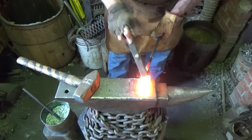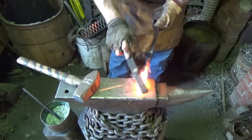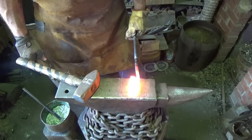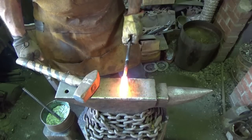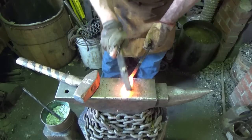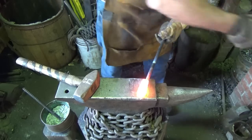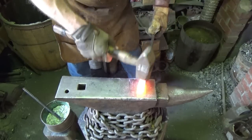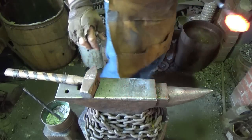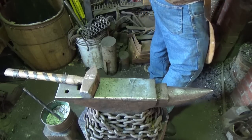Should give us 8 patterns on the end here. Do I want to cut her and do it one more time? Can I handle that high of a billet? I think I can. Let's do it. It'll be 16. Should be something to look at. I don't see anything blowing up on me at the moment. Famous last words. Boy, that gets hard fast. All right, let me clean it up, we'll rotate it. You're stupid, Chandler, you should stop now.